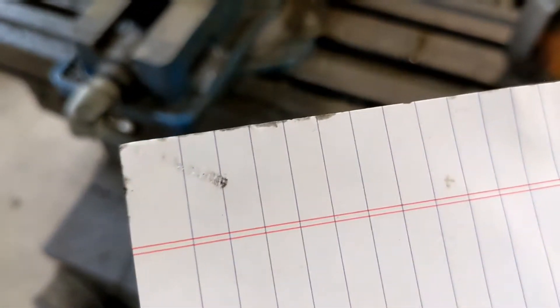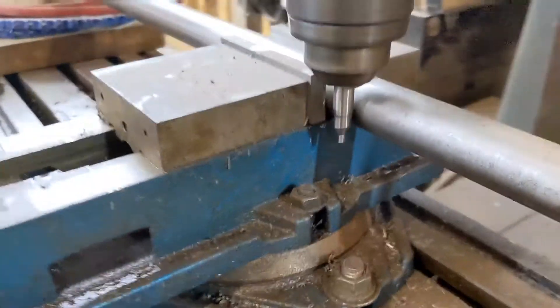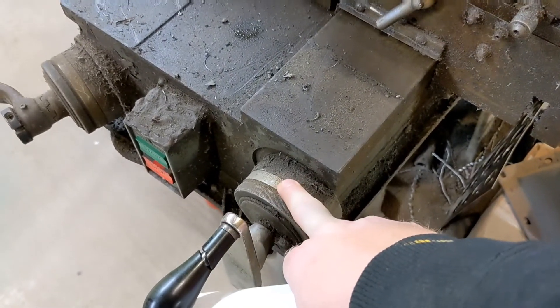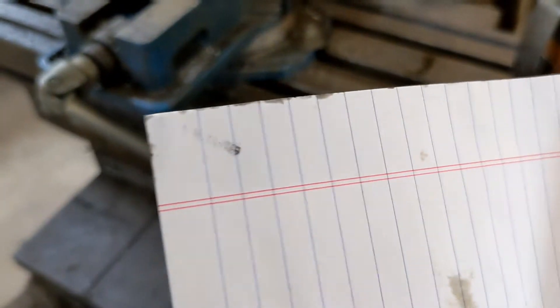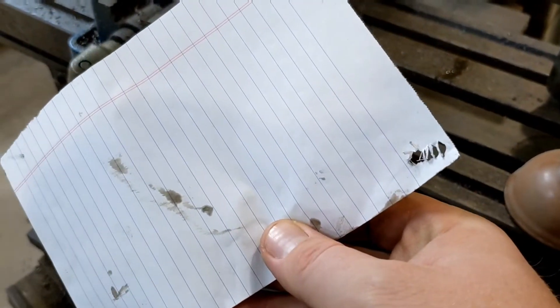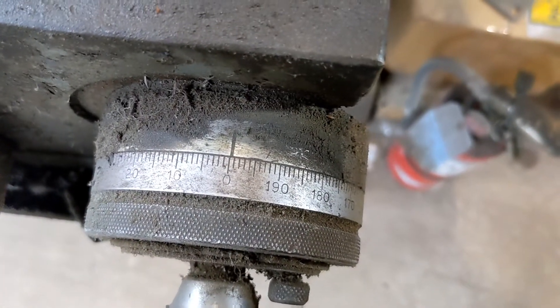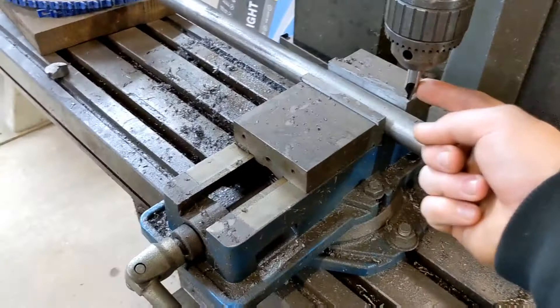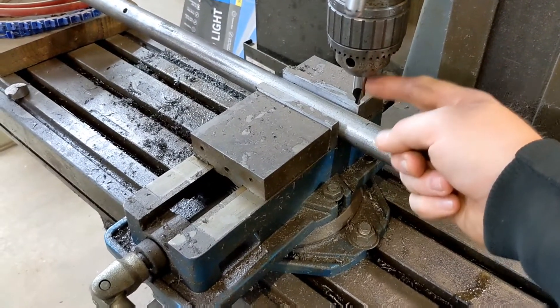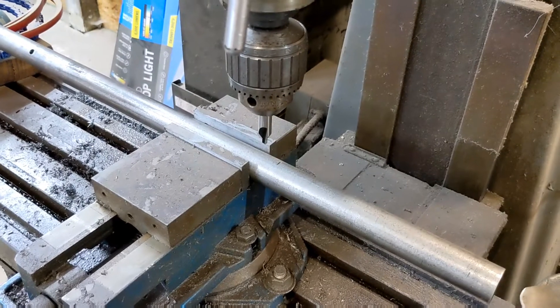You can see here that the bit just started skipping the piece of paper out — I'm running very close to the shaft right now. I will now mark my crank off at zero, because we did not cut the paper the previous time; it started cutting the paper, which would mean I was actually a little over zero. We've zeroed out our dial. Now I'm going to crank this 811 thousandths to move the cutter bit to the center of the shaft, and then we will use our center drill to get the hole started, then our pilot drill bit, and then our finish size drill bit.